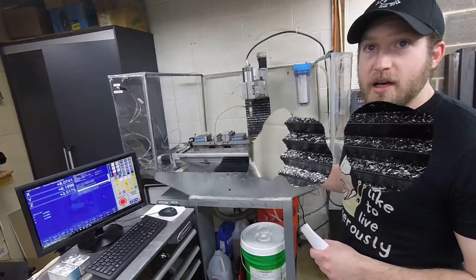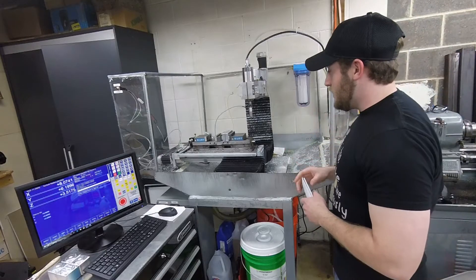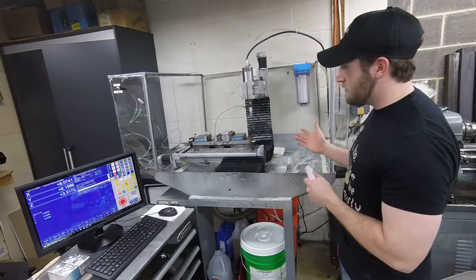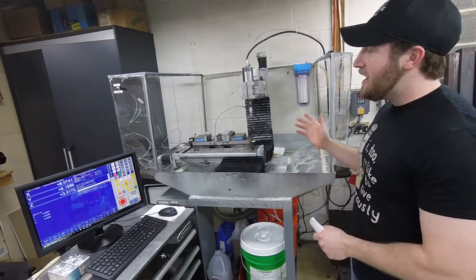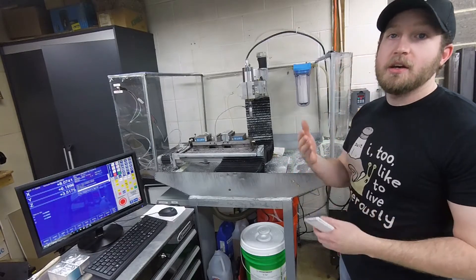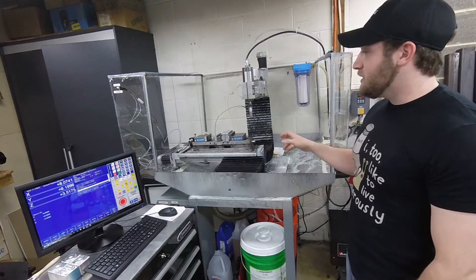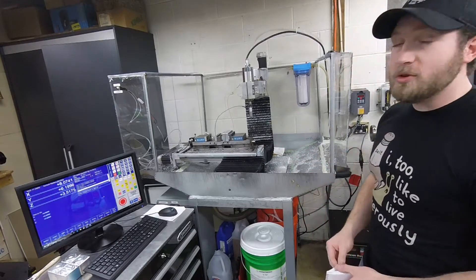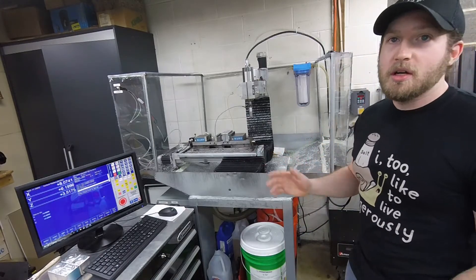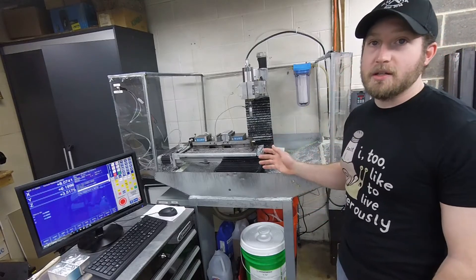This used to be an X2 mini mill, the small benchtop size. Over the years it's been upgraded and changed, and a few things have become majorly apparent that it's not the same. It now runs two Y bases that have been cut, welded together, and surface ground so they're perfectly flat. The table is an aftermarket from Grizzly for a different benchtop — a 22-inch table by six and a quarter. A lot bigger, and the movements on the machine have gotten a lot bigger.